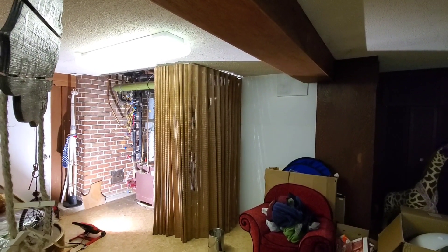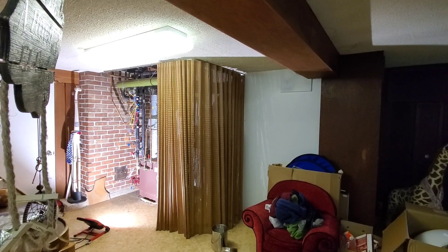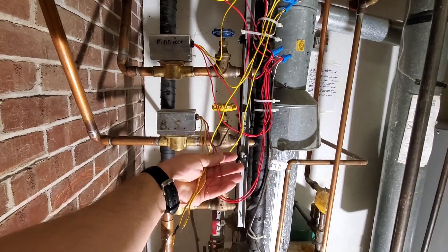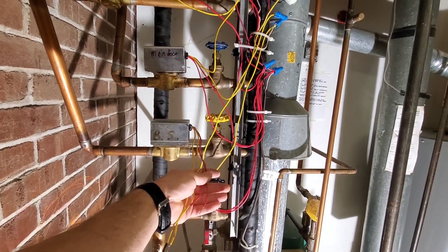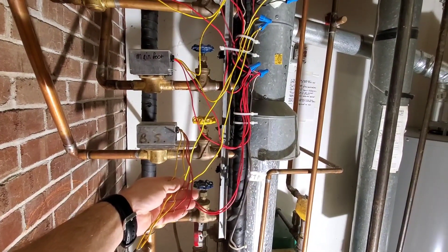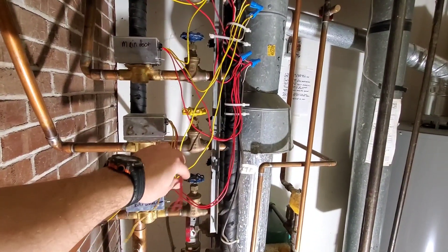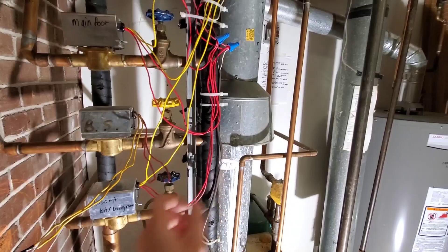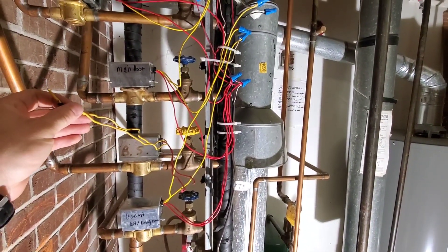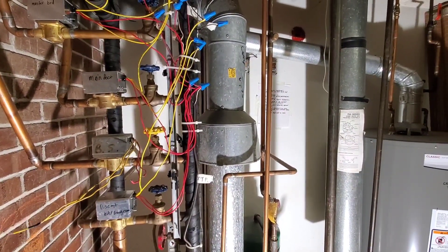Keep in mind you also don't want to be too close to the boiler, because the heat coming off the boiler will offset the thermostat reading. This is our zone valve — I never connected it because we didn't know where the thermostat was. The plan is to run the wire back to the motor and end switches, connect those together, then connect to the thermostat, and if everything goes according to plan we'll have a functioning zone.